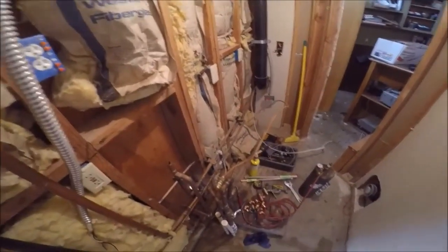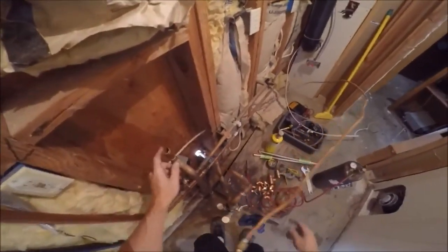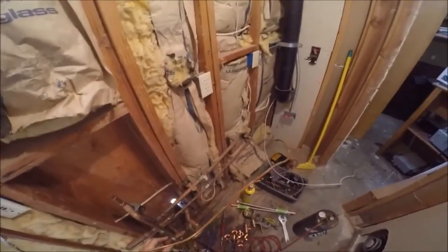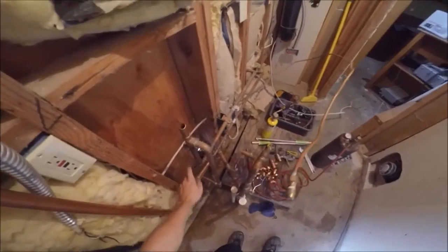All right, we're back. Today we're going to be doing a 50 gallon electric water heater installation and straightening out some of this mess they have here. There was a 3/4 feed that went up over, around, and back in. It was crooked, hanging sideways, so we could get rid of that eyesore permanently, and I'll build a manifold here straight across. The rest of it's feed, so I can't clean that up.